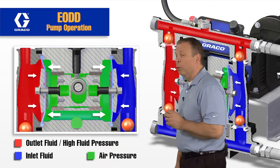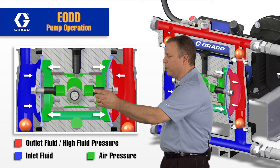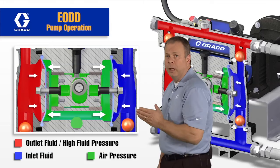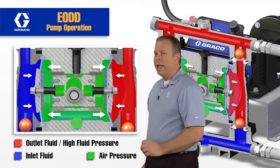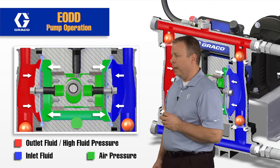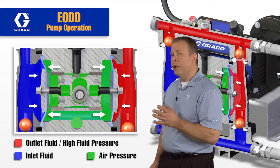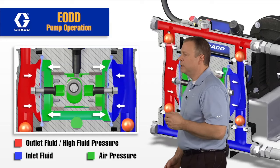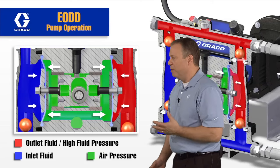Now let's take a look at the inner workings of the diaphragm pump. A couple of things I want to call attention to. The first thing is we've got this eccentric cam in the middle, and that's what's creating or giving that rotational movement a linear movement. The other thing I want to point out is on the interior here, we have, in green, pressurized air. So you do have to pressurize the center cavity of this diaphragm pump. We're going to talk about how you pressurize it and what the different pressures mean as we go through here. But right now, this whole area here does have an air charge on it. As this eccentric cam is going around, we're going to stop this animation right in the middle.